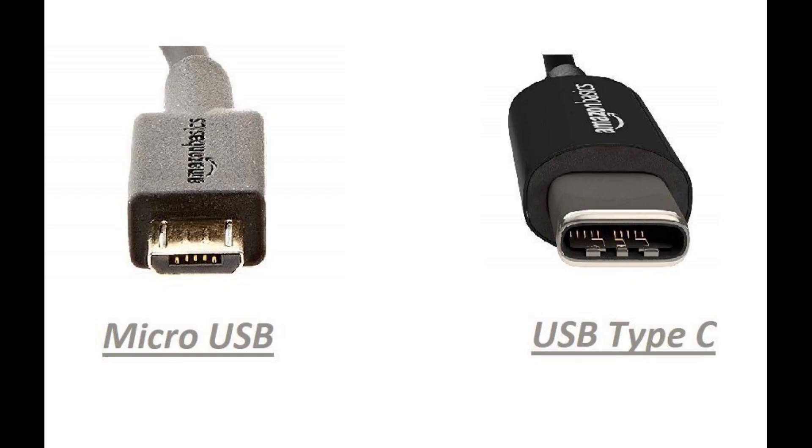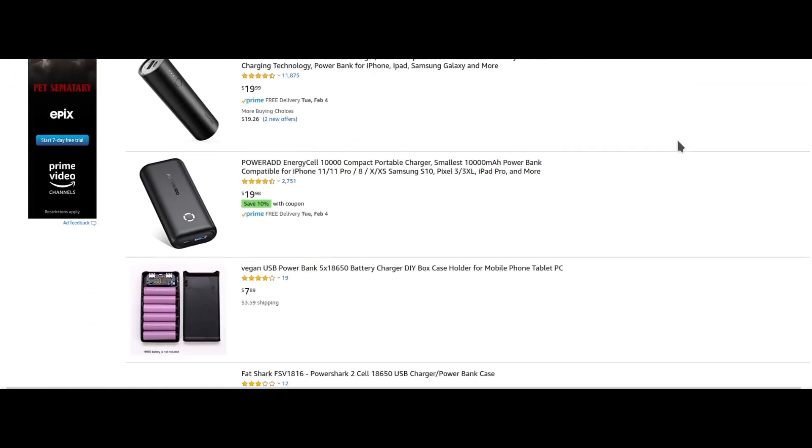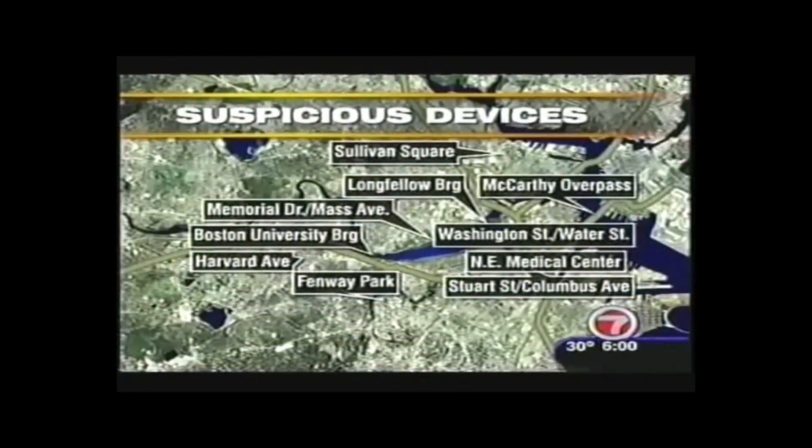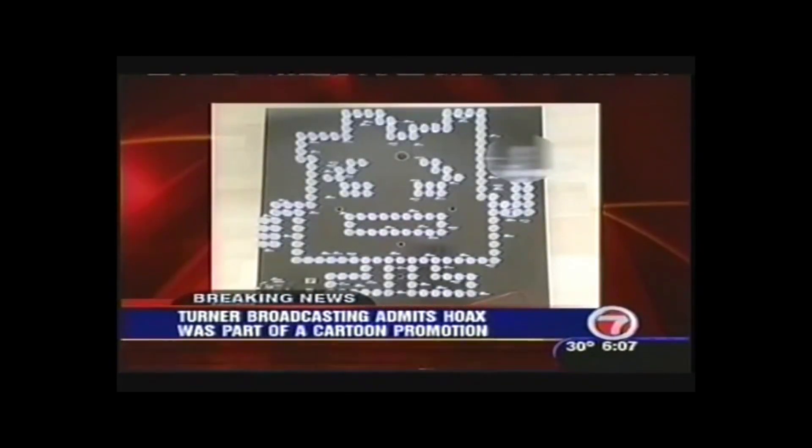The Raspberry Pi Zero uses micro USB — the connector most commonly found on Android phones before USB-C. I use some cheap micro USB adapters to let me plug in a thumb drive to the device. To power it, use a USB power bank or other 5-volt power source. I'd also recommend making the unit inconspicuous so people don't think the circuit board with wires and a battery is somehow a bomb — that would undermine any positive political message. As we said before, you won't be doing anything naughty like leaving it somewhere where it might intrude upon other radio signals in a small 30 to 60 meter radius. Yeah, we're not going to be doing anything like that. Thank you for watching, and I hope this is something you can find useful — there will be more to come in future episodes.